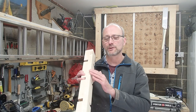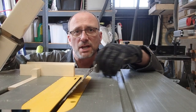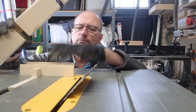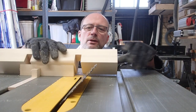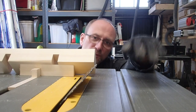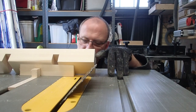Since the corners of walls have caulking and paint in them, I'm going to have to round over the back corner. I use the jig I made with the blade set at 45 degrees all the way out. I place this with the rounded side up against the fence, and what I want is the blade tip to where I can barely see it protruding past.